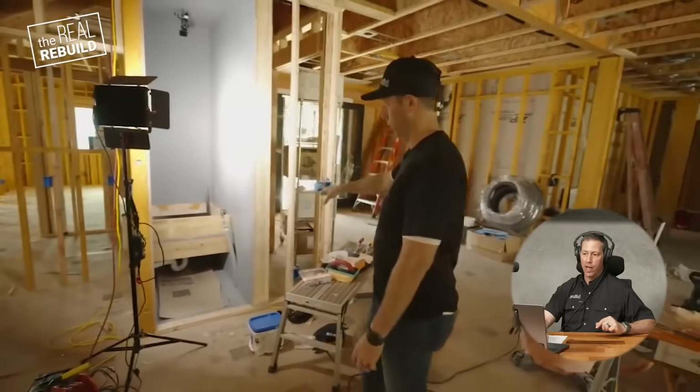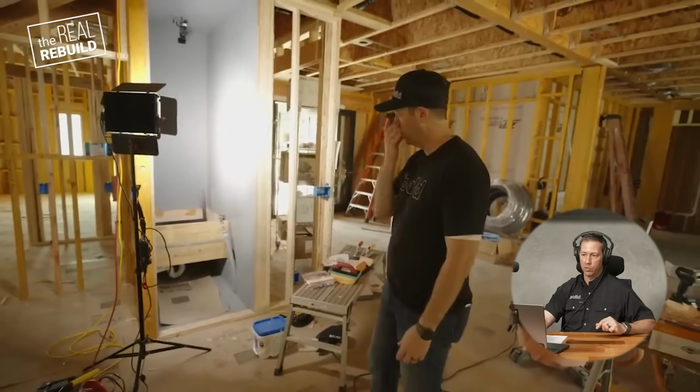The trap which is underneath my water heater closet, the trap which is underneath my kids' bathroom floors, and my laundry, they all have a trap primer that is gurgling just a little bit of water every time I brush my teeth, every time I run the water in my sink, all those locations. So now those locations are kept nice and wet.